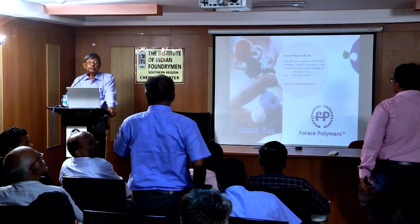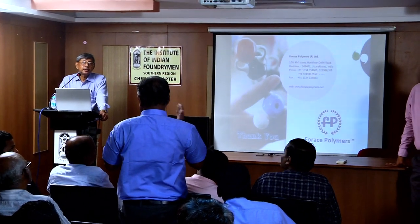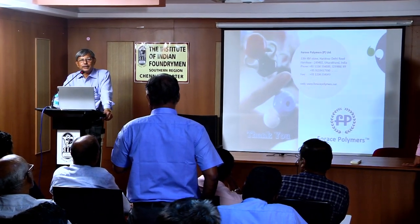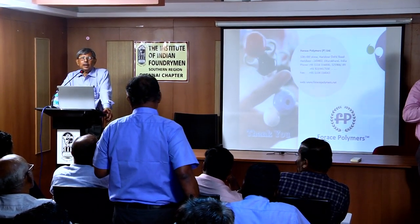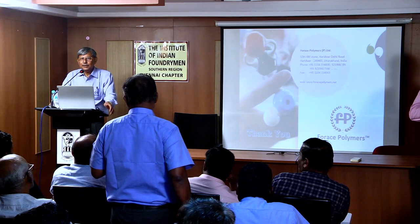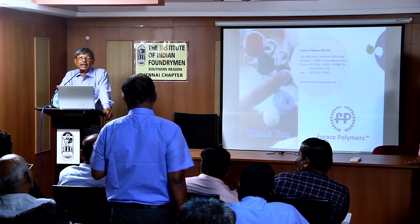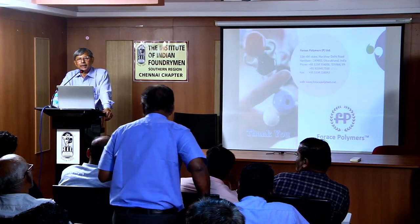Sir, is there any improvement on the chemistry side to reduce veining without adding anti-veining additive? Any reduction of core veining defect? That is possible. Veining basically comes from the brittleness of the core, correct? It cracks due to lesser hot strength. Plasticity and brittleness are two opposite terms. So there are ways to reduce the brittleness, and there are phenolic resins which can do it.